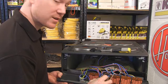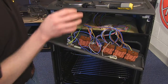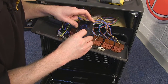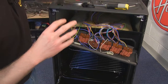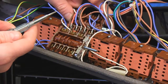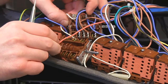The wiring is quite complicated and some of the wires are exactly the same color. So what I'm going to do is take a photo for reference, and for the same reason I'm going to change the wires over onto the new selector switch one at a time, just to ensure I'm doing them in the right order. I'm going to use a small screwdriver to prise off the electrical connections and then put them in the new selector switch in the same position.